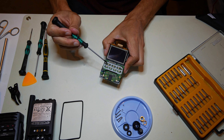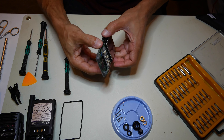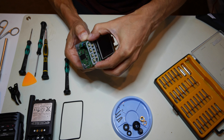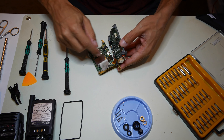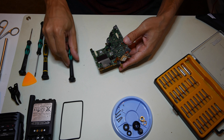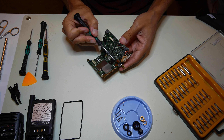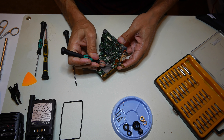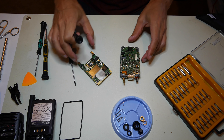On this radio, right underneath here there's a connector that connects the top board to the bottom board — the main bus. You want to pull down at the bottom region to pull and disconnect it, then tilt it over. What you have is the GPS and the switch both connected through a ribbon cable to the board. The GPS antenna isn't just an antenna — the whole module is underneath here. Using a small flathead, lift up the little flap in the back, which causes the ribbon cable to come right out. Now we have our two halves.